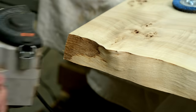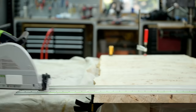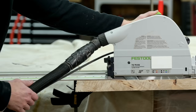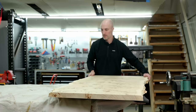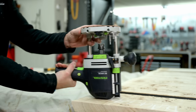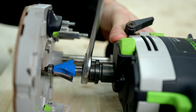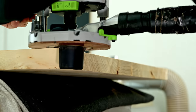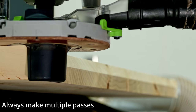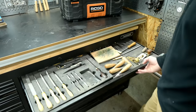At this point in the build you might be thinking this desk looks similar to one I built a couple months ago — the myrtle wood desk, which was some of the most incredible wood I've ever seen, but also probably my most controversial build. I'll include a link in the description to that build. These desks are actually going to end up wildly different. One thing I did like about that one that I'm keeping on this one is adding a 22-degree chamfer to the end. I just tend to like these little beveled undercuts on the ends — even with the live edge, it's a little more interesting than a straight 90, but by no means is it necessary.